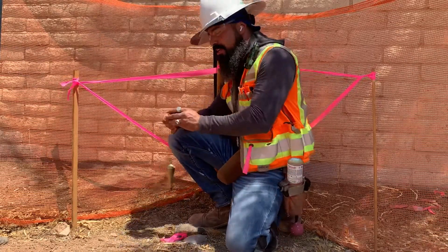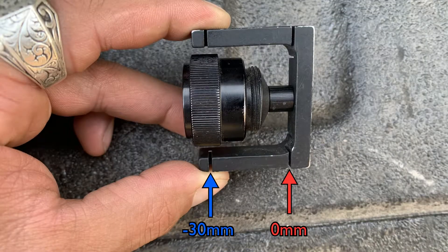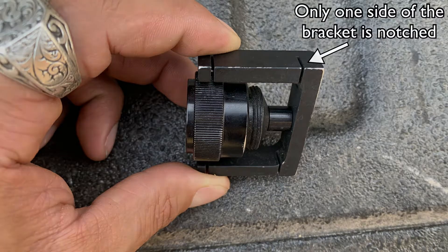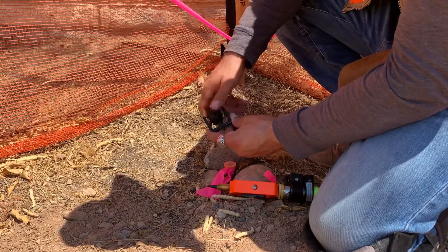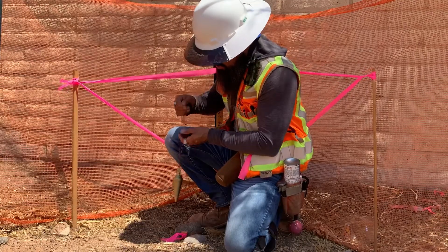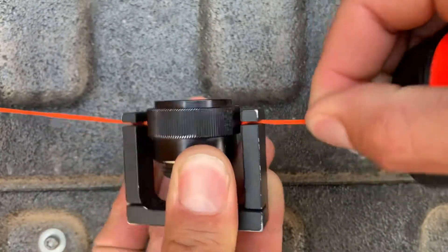So there's a quick review of the fundamentals. Let's talk about this bracket. Just like most of the other mini prisms, it has two mount settings — the negative 30 and the zero — and those positions are clearly notched if you own one of these. This peanut prism just unscrews from the shield of your existing mini prism and threads right into this bracket. When you are attaching the bracket to your plumbob string, you just use those notches, which are typically defined with a little piece of text that says negative 30 or zero.